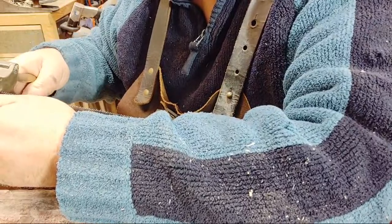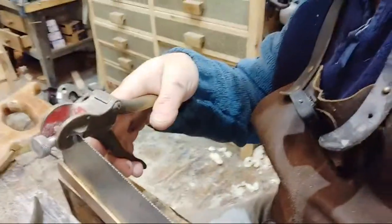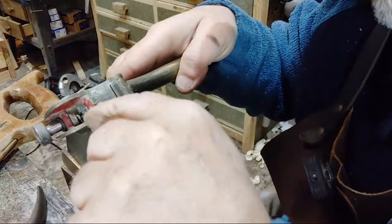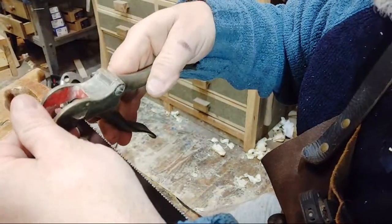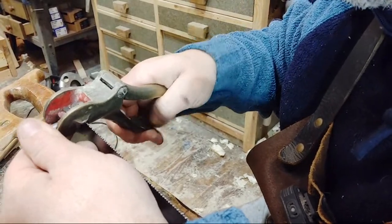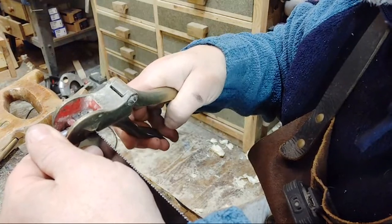Gently get a little squeeze out onto the tooth. Let's bring it a bit closer so you can actually see. Hopefully, you can see. Legs of the tripod in the way. There you are. So, basically, there's a little anvil in there, and it squeezes the tooth, like a hammer and an anvil. I'm bending the tooth over, every other tooth over.